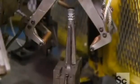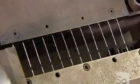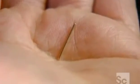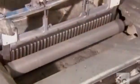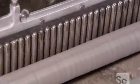A spot welding machine tacks the 2 halves together, forming a handle shell. To fuse the halves completely, this machine cuts a piece of copper-based wire and drops it inside the hollow handle. A furnace melts the wire so that it flows into the crevice between the 2 halves, soldering the seam thoroughly. An edging machine grinds the solder line until it blends in with the surrounding stainless steel.